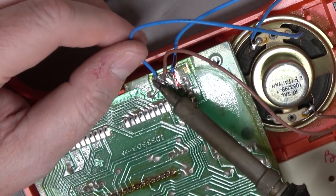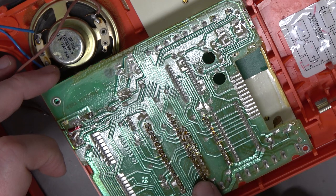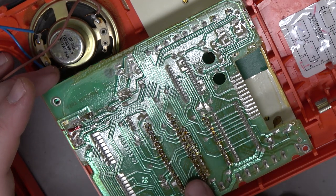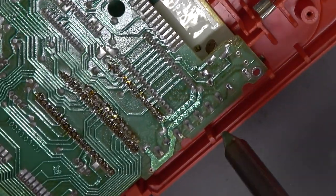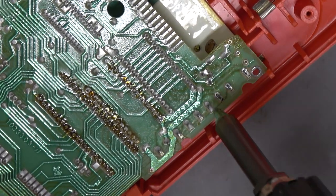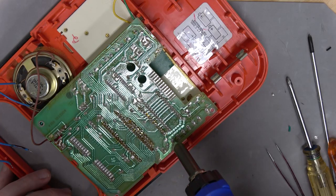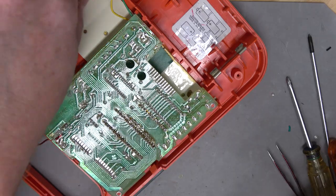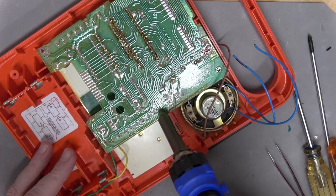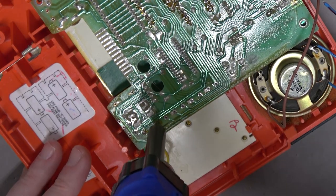This era of solder is guaranteed to smell like Tang when you heat it up. Some of this was wave soldered, but then this was clearly soldered by hand. It looks like this is going directly to the VFD. I wonder if it's degassed or if there's something wrong with the driver chip. I'm going to run the HAKKO at one of the lower settings. It would be very easy to ruin these traces because the copper is glued to the PCB — it's so old, it would be pretty easy to cause it to lift.